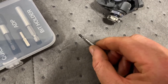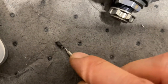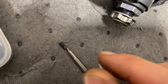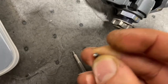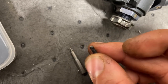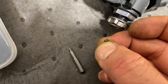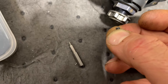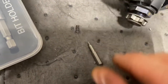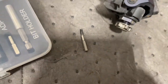That's what's nice about this extractor set I got. It has little threads on the end, so when you go in reverse it will actually grab it and pull it right out. You can see there where I drilled down inside — not very far. I just needed to get a couple threads because this wasn't Loctite-ed or anything. There was only about that much showing, so I drilled inside, got the little bit in there, it grabs, and pulls it right out.